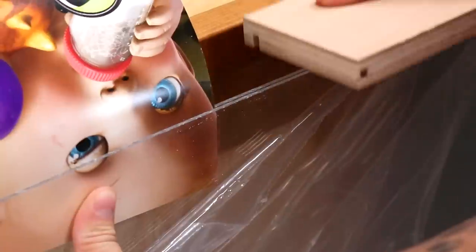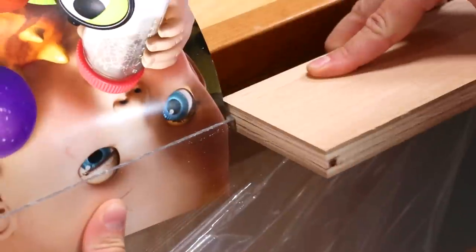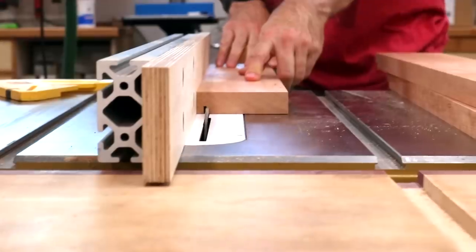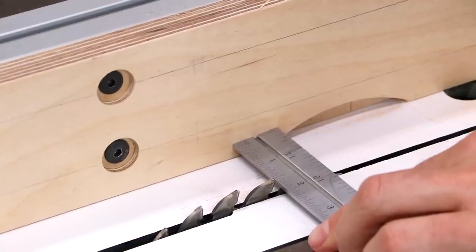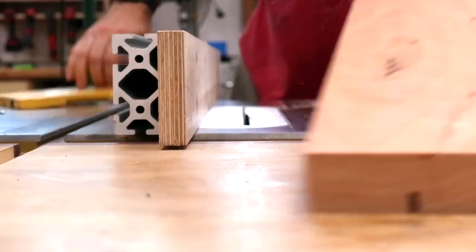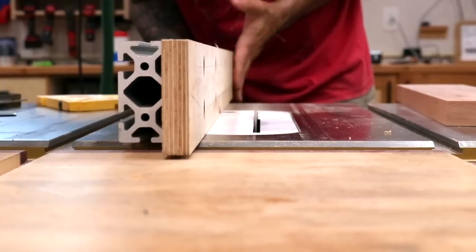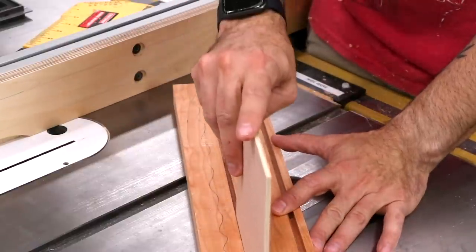The poster will live between two layers of plexiglass. With the creepy baby head in there, I'm looking for a fit that's a little bit loose since the plexiglass needs to be able to slide. With that setting dialed in, I can make the second cut on all of my frame pieces. I'll use the same process to make the back panel groove. My back panel is set in from the back of the frame far enough to allow me to plug in the LED light strip. You can move the back panel to suit your needs. Just like plexiglass, you want the back panel to slide into the groove easily.